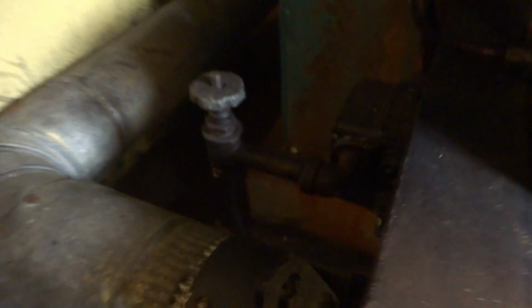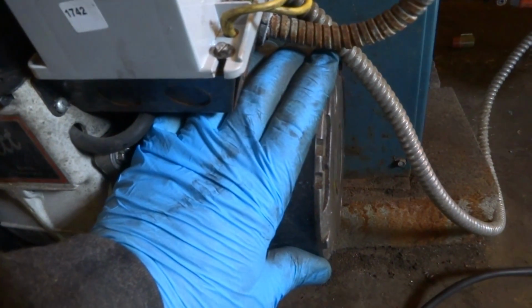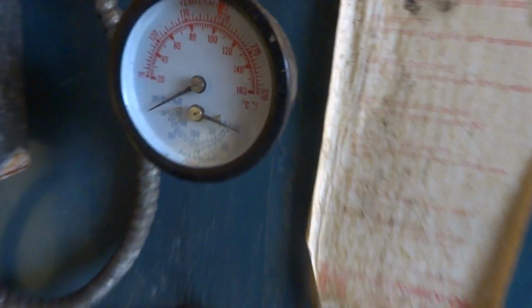I think it's coming from the motor, not the pump, because I did have a good oil flow last time I was here. Don't look like we've got any pressure in that boiler there, do we? Gauge is probably shot. Last time I was here was 3.8 and put a new power venter, new nozzle, new filter at tank, new oil pump filter. So that wasn't that long ago.